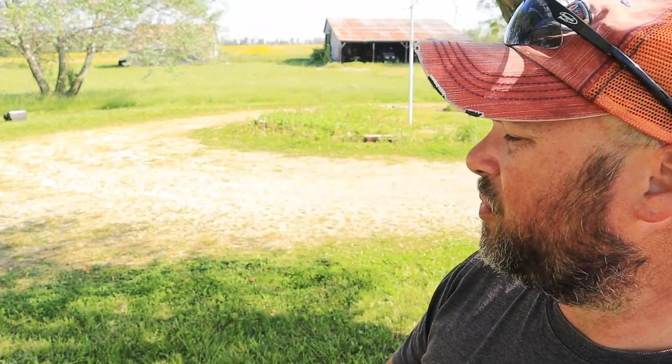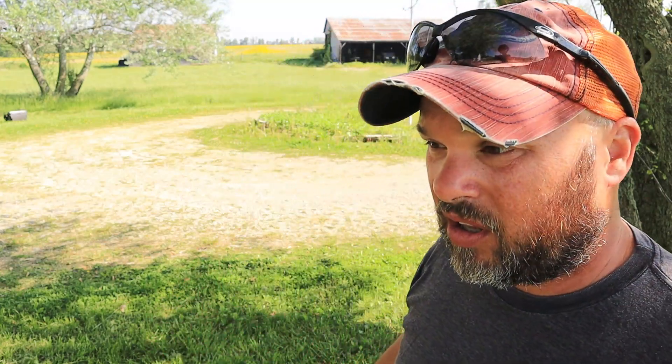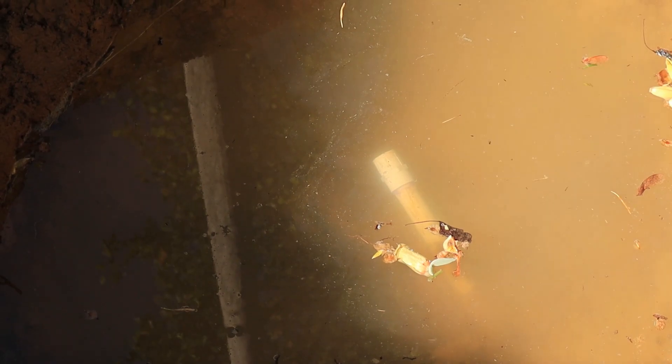We want to do anything simple to help them make it through the hot summer. Another thing we just finished up this weekend is our water hydrant. We had to dig it out because it was leaking. We took it out and it was cracked right on the weep — the weep is at the bottom of your water hydrant, and what it does is whenever you close the hydrant, the rest of the water runs out at the bottom so it doesn't freeze. It's a frost-free hydrant. Since it was cracked, we went ahead and capped it off. We don't want to mess with the water hydrant out here — if we need water we can always use our well, and there's also a water hydrant out in the big barn.